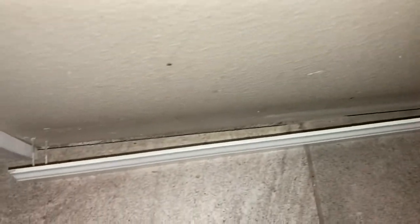And you can see I have a little piece of scrap wood that I'm using to protect the drywall. That is going to be an important concept depending on how easily your baseboard removes. In this case, it's not too bad, but I'm definitely glad I have one. I'll give you another view here in a second of how I do this and where I start. But you can see the concept is to get that little crowbar behind the baseboard, use that little piece of scrap wood, and basically pry that out.